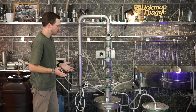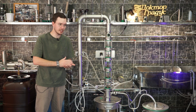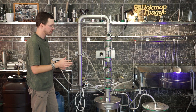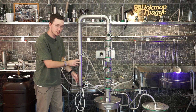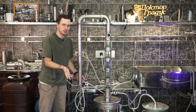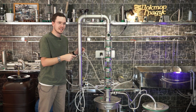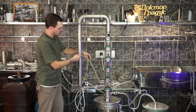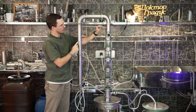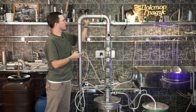As you can see, a lot of equipment and hoses. I have 91 degrees Celsius in the boiler so we're getting close to boiling temperature. While we wait, let me go through the hoses and equipment. First, here is the product condenser — inlet for water down here and outlet up here. Then we have another condenser which we're using as a pre-heater for our mash. Mash goes in here and through this hose going to the feeding unit. Up here we have a steam line.